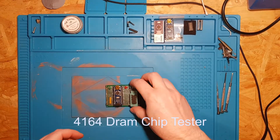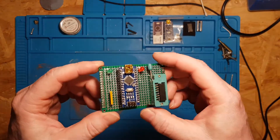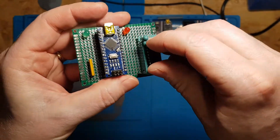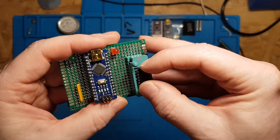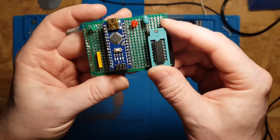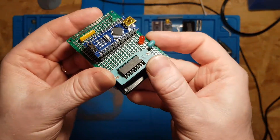Hello, welcome. Today we're going to be trying to solder this little board I've prototyped. It is a Spectrum 4164 DRAM tester — you put the chip in there, close the insertion socket, push the reset button, and once plugged into USB it'll flash through testing every bit of the chip. If it passes the memory tests you get a green light; if it fails, a red light. So it removes any doubt about whether your chips in the Spectrum 128K are any good.